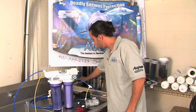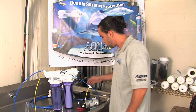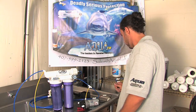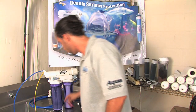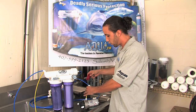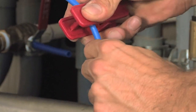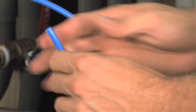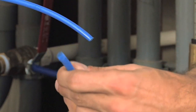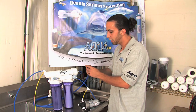What I'm going to do now is show you how to install your booster pump. We're going to shut off the water supply. We're going to take a pair of RO line tube cutters, or anything sharp you have in your kitchen, and we're going to want to cut the line with a nice flat cut — flat cut meaning no angles — so that as we take this tube and shove it into the quick connect fitting, we're not going to have any sort of leaking.